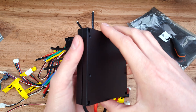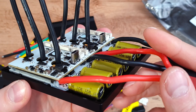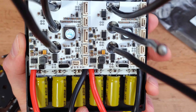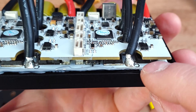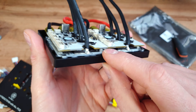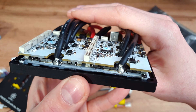Let's open the VESC slowly and gently. And we are inside — check this beauty. Now it looks like a proper VESC. There is no kapton tape inside. All those black MOSFETs are soldered to a thick aluminium plate, and between this plate and the bottom aluminium shell there is lots of thermal paste all around the controller. So it looks like it will be a lot harder to overheat this controller. This is how it should have been done from the start.